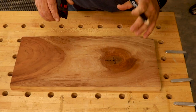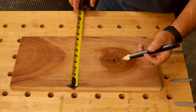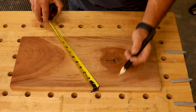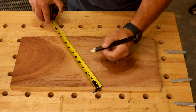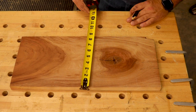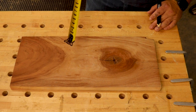I'm pretty mediocre at best when it comes to math, and I've kind of had to fight through it my entire woodworking career. But these next few steps have really helped me out in the shop. So let's say you've got a board that's at a width that's a little hard to do math with — like eight and seven-sixteenths inches wide — and you need to divide this board into equal parts, whether it's in half or by five. The easiest way is to just turn your tape measure, keeping this edge flush against the edge of the board, and turning it to a number that's easy to do math with. I'm going to turn this one to 10, and then right at half of that — at five inches — I'm going to make a mark. That mark is going to be at dead center of this board.